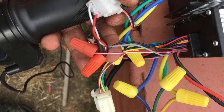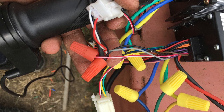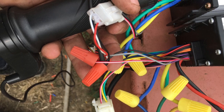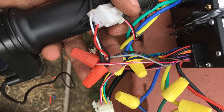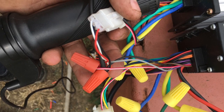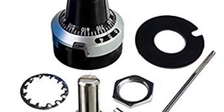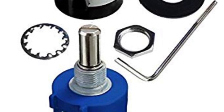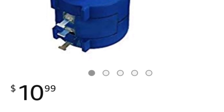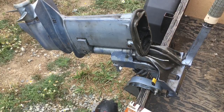The red, gray, and black wires coming out of the motor controller are for the potentiometer. When you buy your motor kit, it comes with either a handlebar throttle like on a motorbike, or a foot pedal for a go-kart. You can also order dial potentiometers if you want something that stays on — just hook it up to these three wires, because that's all these throttles and foot pedals are: potentiometers.